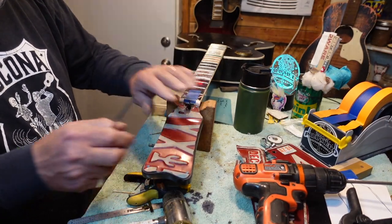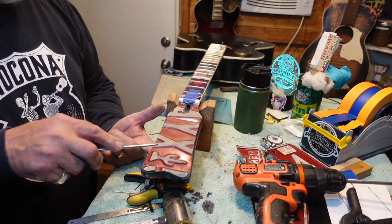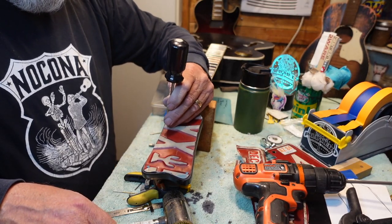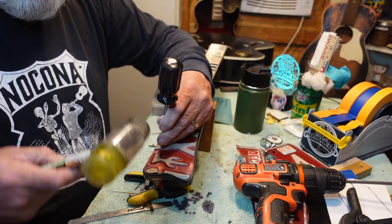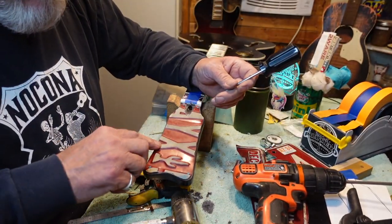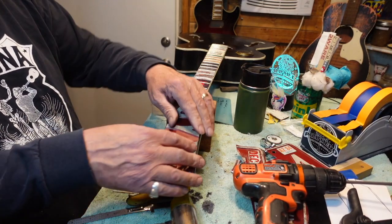For the screw holes, I've got the holes going through the plate but I want to come in with something a little bit smaller and I don't want to drill all the way through the headstock with weird holes coming out the back - pay attention to that. Now that those are in, we're going to pin this down. Feel under here and see where the holes are - there's one right here, another one here, another one here - so we can just pop a screw right here, then one equidistant from the edge between the holes. Carry those across to the other side, drill those out the same way, and get this pinned down.